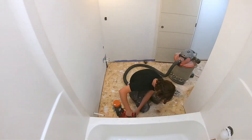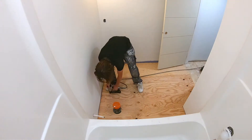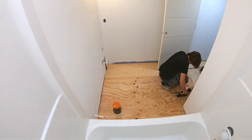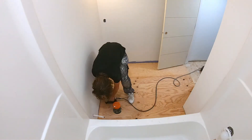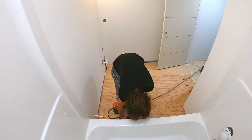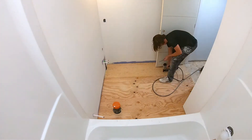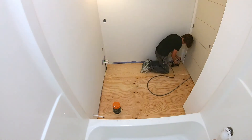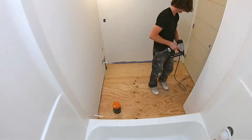The next step was to install a quarter-inch thick piece of plywood on top. I pre-cut this, made sure everything fit, then came back with regular carpenter's glue, glued the panels down to the subfloor panels, and then went over it with an air stapler. The staples are three-quarters of an inch long, going about half an inch into the subfloor panels — no reason to go further than that, as you'd just be hitting the insulation. This is twofold: it ties all the subfloor panels together for a more sturdy tile base, and if any Tapcon fasteners back out over time from vibration, they'll hit this plywood layer rather than coming up into your radiant flooring and potentially cracking a tile.